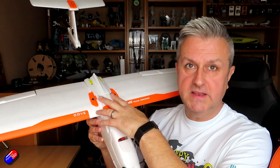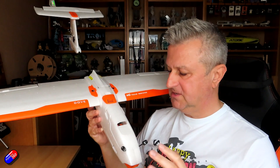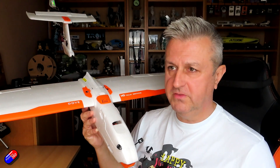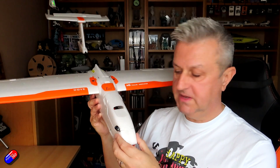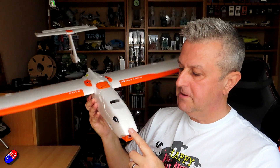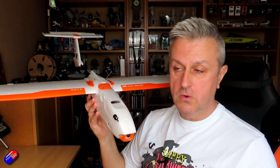The R161 is here at the back, so the two antennas are sticking out at the front for radio control. I want to use this with my old Taranis radio — just the way I want to build this particular one. In the nose there is a Walksnail V1 unit with two antennas, arranged in that kind of V configuration so that as it banks and rolls, one of the antennas is always coming into line with the goggles.